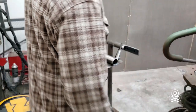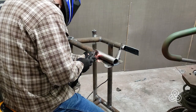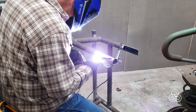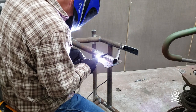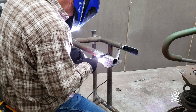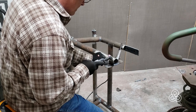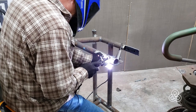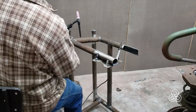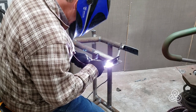Now, another thing — this subframe mount. This top plate is thin sheet metal, and I'm going to put these gussets in just to stiffen it up. The purpose of that subframe having such a light or thin gauge piece of metal is that the whole idea is in an impact — we want those subframes to detach from the car, leaving the tub intact. So all the safety stays in the tub; the engine and front subframes can all be detached from the car in a wreck. Just putting these gussets in as part of the subframe to hold it rigid in place.